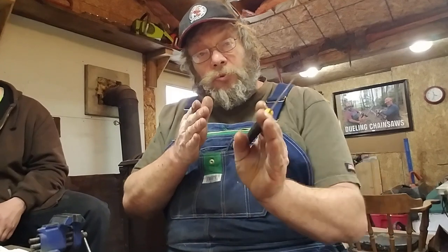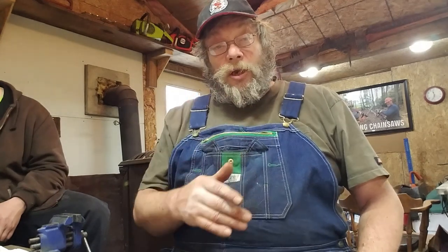As you come in that wood, that grain keeps stepping over and over and over in the board. Look at your boards on face cuts. You'll see what I'm talking about. And then it comes into a big knot, and that grain changes. Your blade wants to try to follow all of that, okay? Until the log becomes square. And then you stand your cants up, rip your 2x4s out, and away you go. You're good to go.